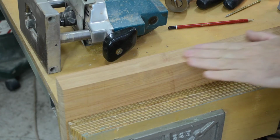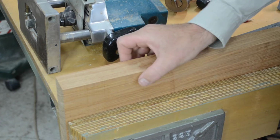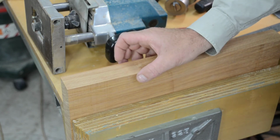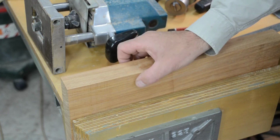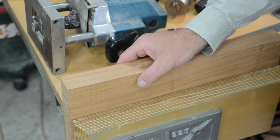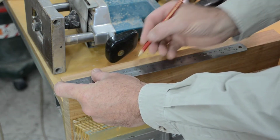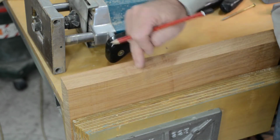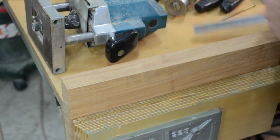Here we have a mock-up of the door. Now, I did the striker according to the centre line of this door. This is like 38mm thick, or 1.5 inches in the old currency. I've set the latch centre point in the jamb at 20mm from the doorstop. Obviously the centre of the door is 19mm, and the height of the door was, the latch was set at 120. Now you might have to take off your clearance, etc., whatever it is you've got to do. But anyhow, that's normally the centre line I'm going to choose.